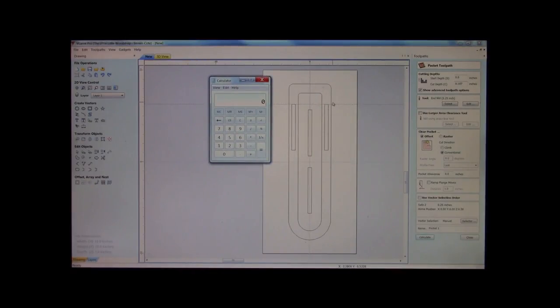I know that from the back side of the clock face to the very front of this frame, I need a 3/8 gap. Now, I know that my bars are 1 inch thick. I'm going to take 1.0 and subtract 0.375 because that is the gap that I need. That gives me 625 thousandths left over.